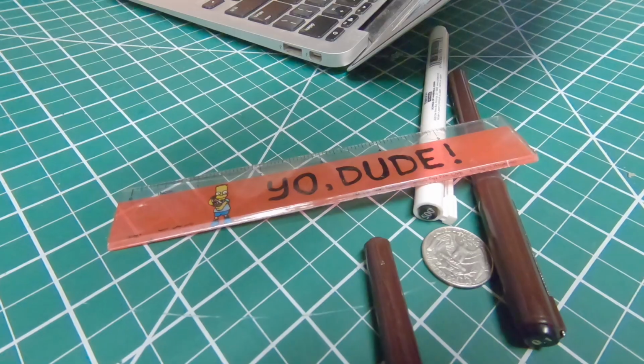I made a drawing, scanned the drawing, cleaned it up in Photoshop, exported it as a JPEG, then opened it in Illustrator, traced it, and exported it as an SVG. Now I'm on an internet-connected computer trying to convert it to a DXF so that I can throw it into SolidWorks and extrude the drawing as a stamp.